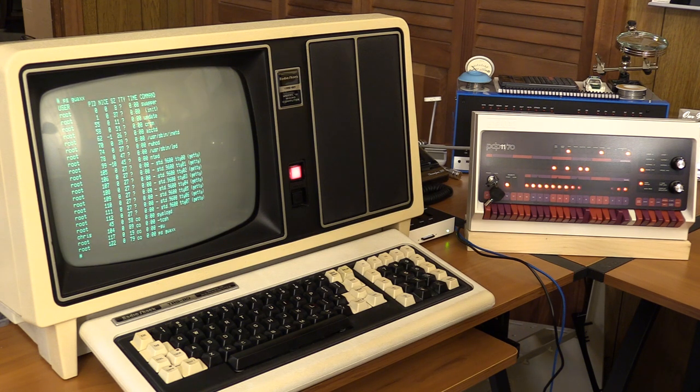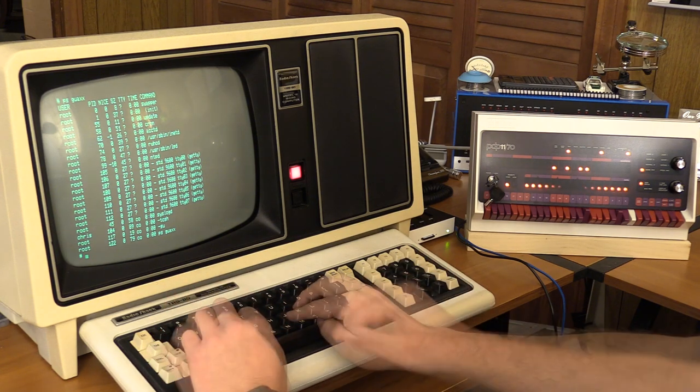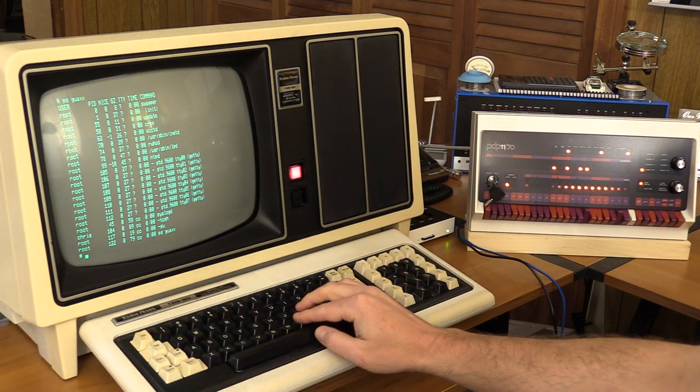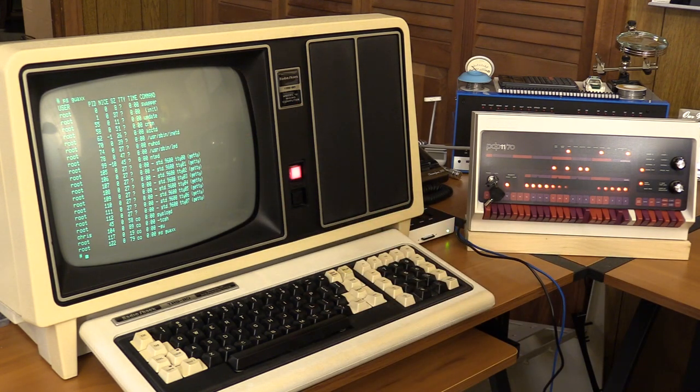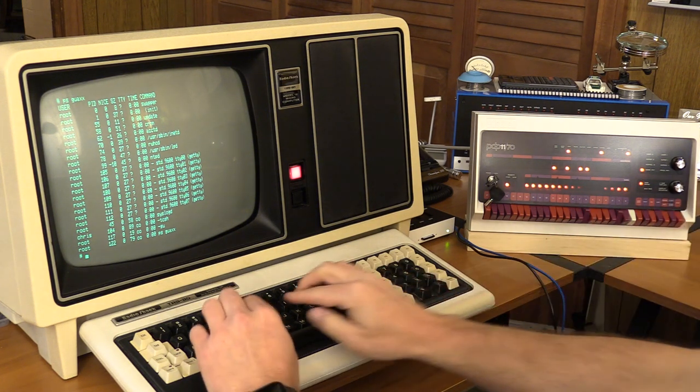Now it's gone. Seems like an open sendmail running on my network is a bad idea. Sendmail's always been kind of a hole. So we have a bunch of stuff running. I have my inetd running, which, by the way, has an HTTP server running as an inetd process. In a second, we'll take a look at that by connecting to this from my Tandy 4825SX.